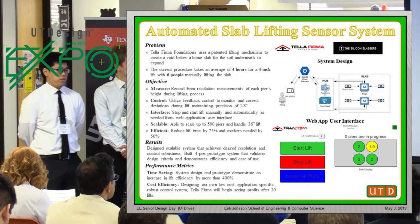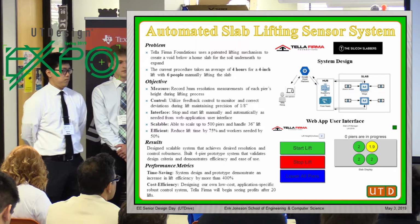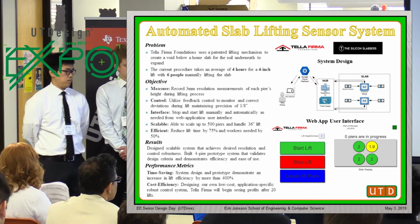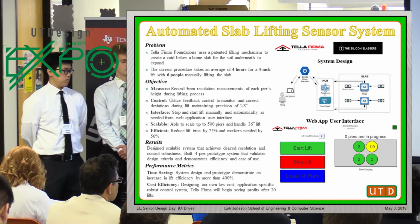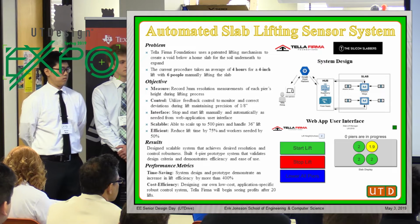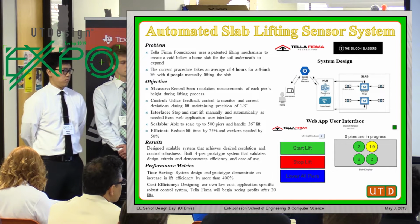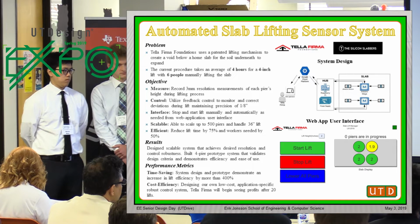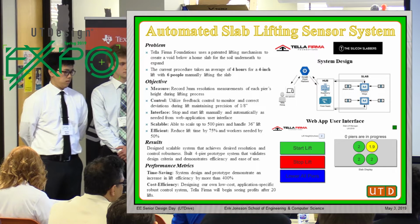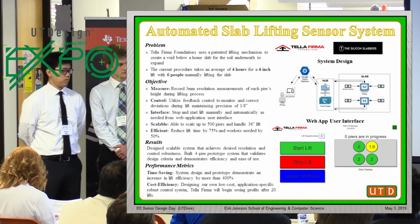As you can see in the diagram, the Raspberry Pi, which is our hub, is placed off the slab and hosts the feedback controlled software interfacing with the on-slab Arduinos. The communication between them is RS485, which will aid over long distances. In our prototype, the Arduino communicates with the sensors and the actuators using an echo trigger system, and the hub, which is the Raspberry Pi again, connects with the server and uploads the data to Google Cloud Platform before being displayed or controlled through our web application.